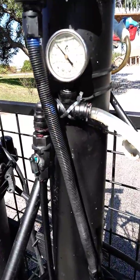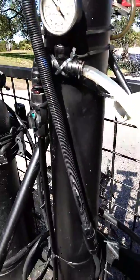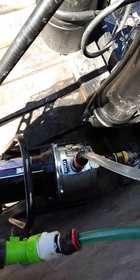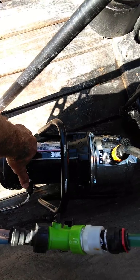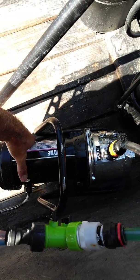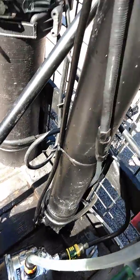That's just a little setup right now. Sometimes you do get a little vapor lock with this thing. It also has a little to do with voltage because I'm running over 100 feet on this pump. But when that does happen, you just got to turn your water off, release the pressure, then it'll pop and crank right up.